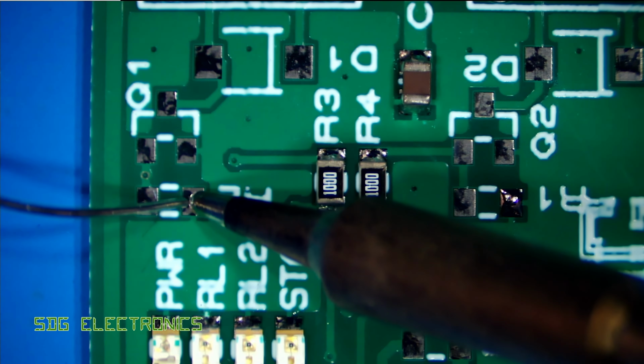power. So certainly you can see the moment where I touch this one that's connected electrically and we get some weird readings. It does jump up, but not for very long. But then if I touch one of these pads over here, obviously you get no reading at all. So there is some influence. It means that the system isn't isolated, which is what I'd noticed before, but perhaps in firmware they found a way to find if the reading goes way off, then obviously to disable the heater. So it does look like they've come to some kind of fix around that issue.